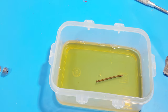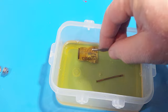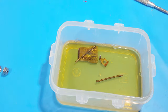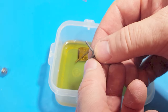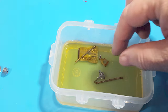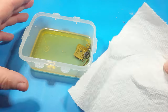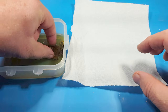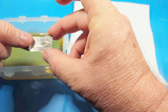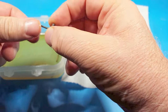Here's the rust remover. This is a long-term solution I put my steel parts in. Here's the towing hitch — I don't actually put that one back on — and then the steering wheel. There's a bit of rust on these things so I leave them overnight, and when they come out the rust is all gone. I generally do this with all the metal parts if there's rust on them. If there's no rust, you don't have to do it.